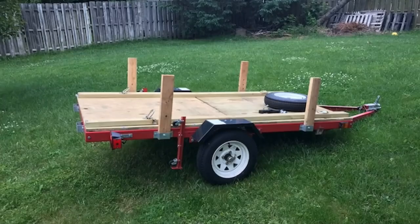A couple of things I've learned: if you want to be able to fold this trailer, make sure you cut that piece of plywood in half before you start attaching it. Also, when you go to fold it, you have to remove some fasteners beforehand — otherwise it's too rigid and it won't fold up. The rear end folds up over the front and you can stand the whole thing up that way. Personally, I'm too lazy to remove fasteners every time, so I just drag it to the backyard. My garage is too cramped anyway.